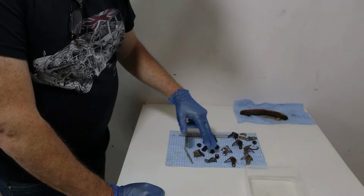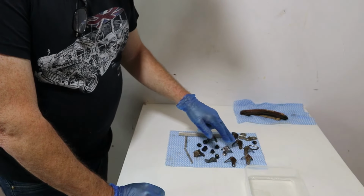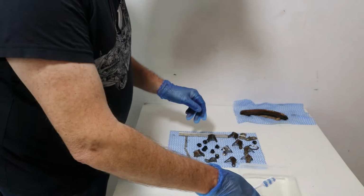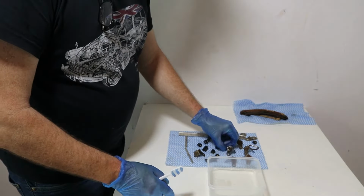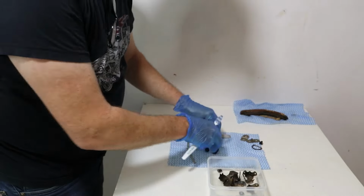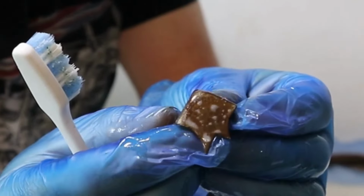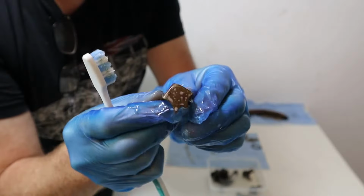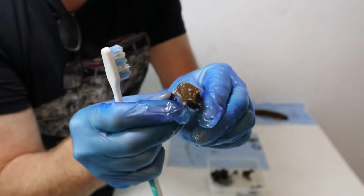The strip has been working a little while. I'm just going to gently remove that with a toothbrush and some soapy water, which will neutralise at the same time. Once I've cleaned all the varnish up, I'm just going to give them a gentle buffing just so they don't go rusty. I'll just put a bit of wax on there as well to take care of those.